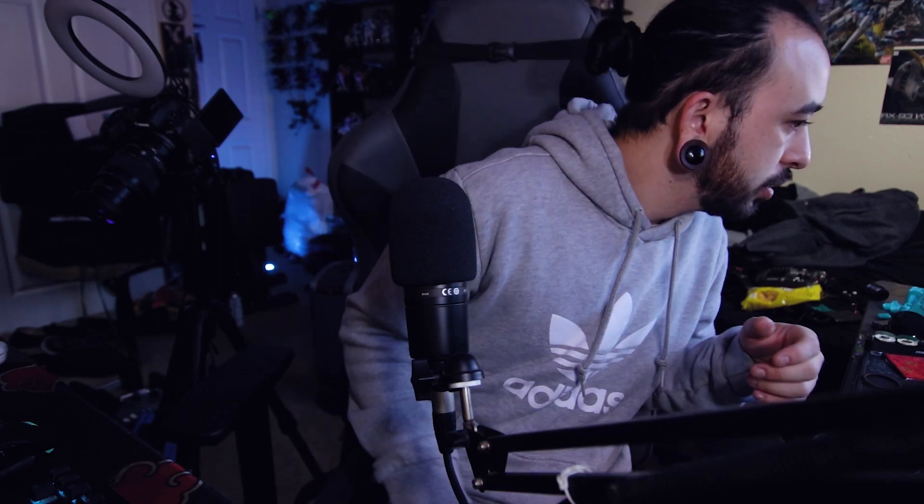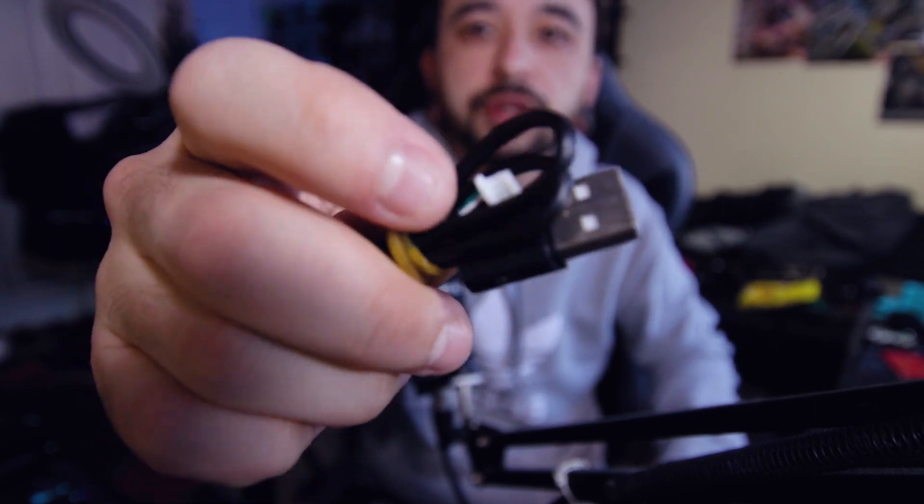Now the things you're gonna need: first is the USB cable, which has the little JST connector on one end and USB on the other - that's what you connect to the drone and then to your computer. Next you're going to need the firmware files, which you can find through the Discord channel. And one last thing - to make sure nothing overheats or gets damaged, you want to have a fan next to your drone while updating so it stays cool and doesn't brick the VTX.